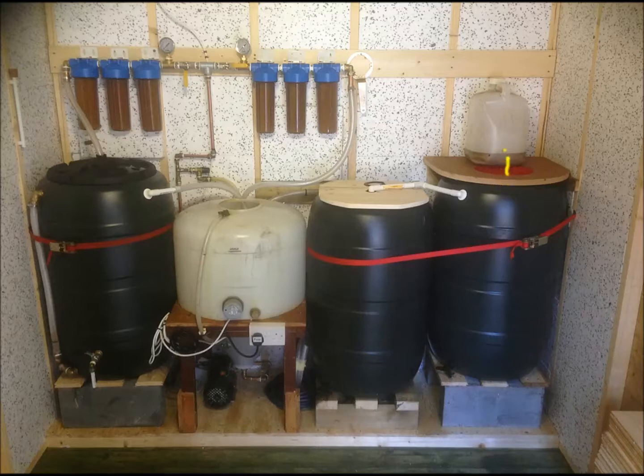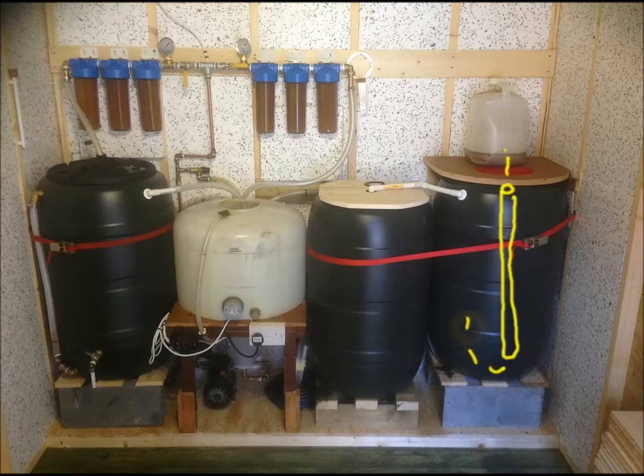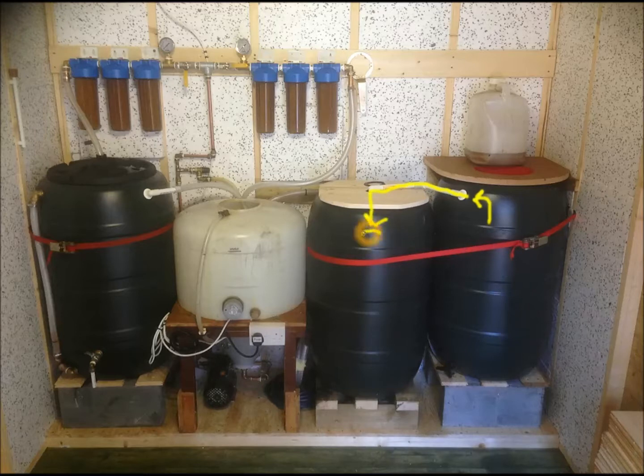The oil drains through slowly into a sieve. There's a sieve contained within a funnel, and that goes inside a pipe which is on the inside of this barrel, all the way to the bottom. So the oil flows down there, introduced to the very bottom of the tank, where it slowly seeps upwards. Nice and slow, because this is a settling process — we don't want speed. All the clean oil floats up to the top, and of course it's got to go out somewhere, so we build in an overflow. This is the overflow pipe here, and it overflows into this next barrel here.